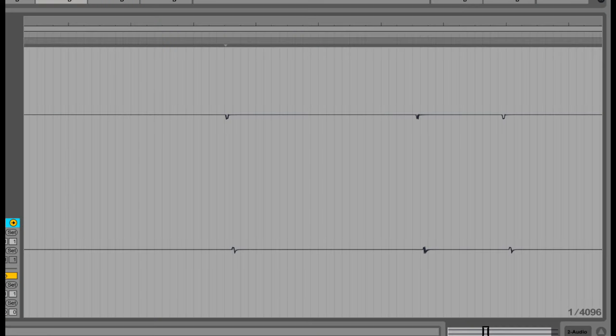And I have two MIDI throughs. One is a MIDI Tech and one is a MIDI Man. And I investigated both of them, and the MIDI Tech has a delay. And that's absolutely no surprise, because in fact it can filter signals. So it has to read them in so it can filter them. That's the reason I bought it in the first place, specifically because it can filter MIDI clocks, ironically enough. The delay is 0.4 milliseconds. That's not a problem in practical day-to-day use, but it's a problem in this case.